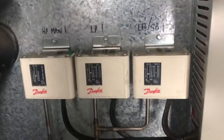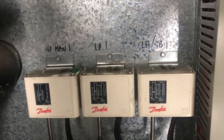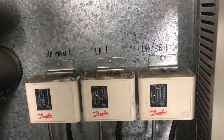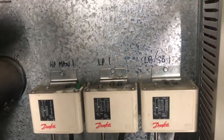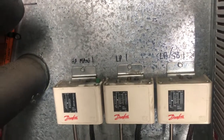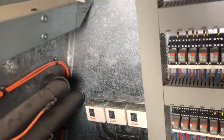You have the safety devices: the LP low-pressure switch, then the high-pressure switch with manual reset — which is a great thing — and then the low-pressure setback. If the pressure goes too low, it will cut one compressor so the pressure will come back up higher.